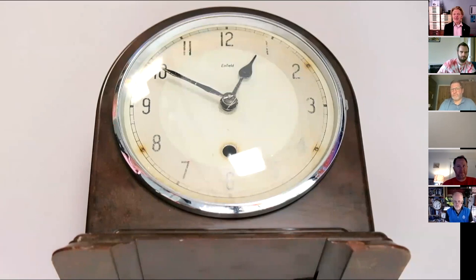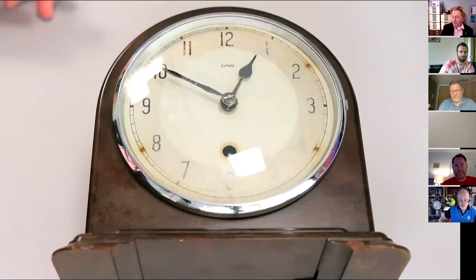And that leads me neatly onto the next point, and that's health and safety. There are really two areas of health and safety that are really important here. One, as you'll see in a while, is that to clean our clock once it's disassembled, I use mineral spirits. So that's either white spirits or paraffin, which is called kerosene, I think, in the States. And like any solvent like that, it must be treated with care. It must be stored safely out of the reach of children in a fireproof container and disposed of responsibly.